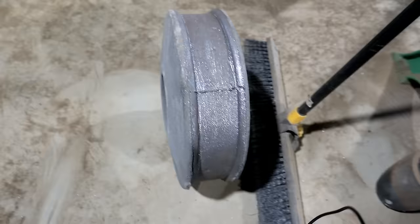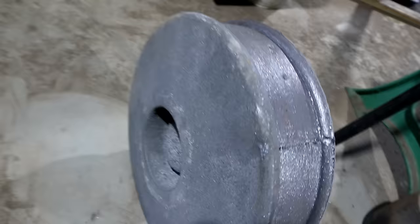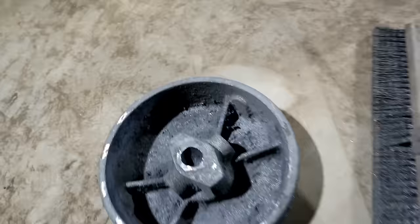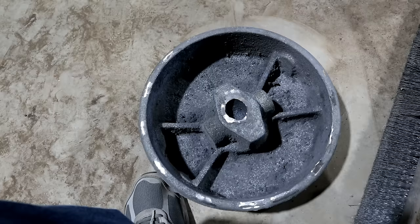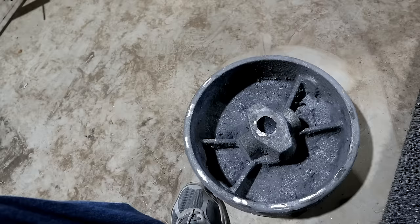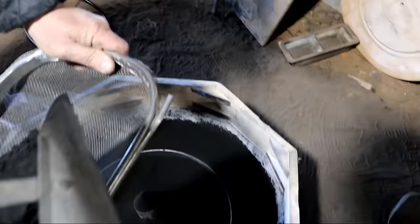Not only does he have to pour this thing and get it out of the mold and take it apart, there's cores that we made to go here so that you get these lips. And then there's an inner circle. And then all of this in here. This one wasn't good enough. You don't know until you pour. This one had a cavity here. So coming out with a perfect one, the first two or three tries with a new pattern, is very difficult. And every bit of sand that we put in here has to come out. Without cracking. Moving. Getting in the way of anything else.